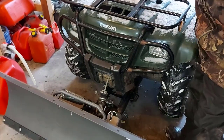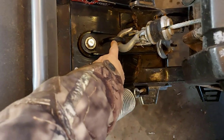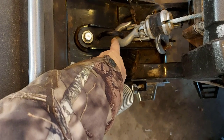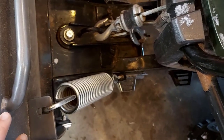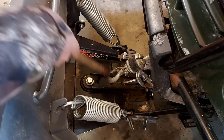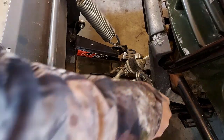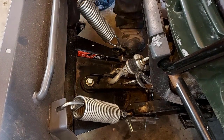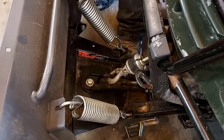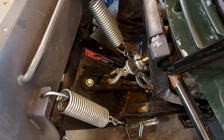So here are the hooks I was talking about. This hook is for operating the snow blade — lifting it and lowering it. And this hook here is for when you want to hook up the snow blade to the mount. When you step on these pedals here, you can swivel the blade in two directions on the right and two directions on the left.